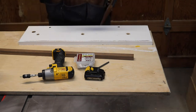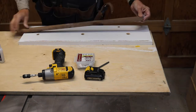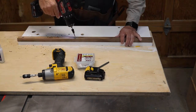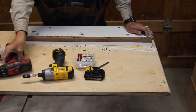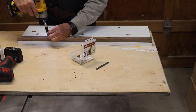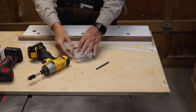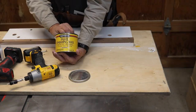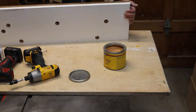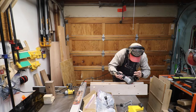Next comes putting a strip on top of the eight-and-a-half-inch melamine, which will be used for sliding along an additional little jig to push tenons over the saw blade. I roughed up the melamine a little bit with sandpaper, then drilled and screwed on a walnut piece, and threw some wax on there so the jig would slide nicely.